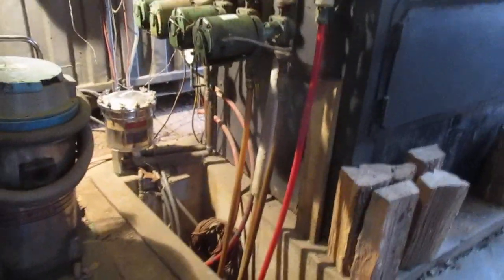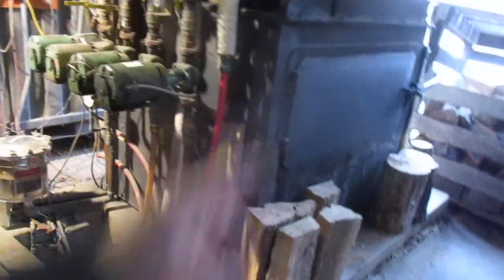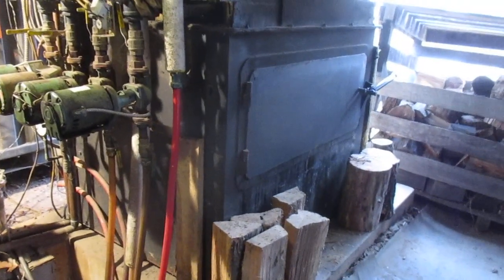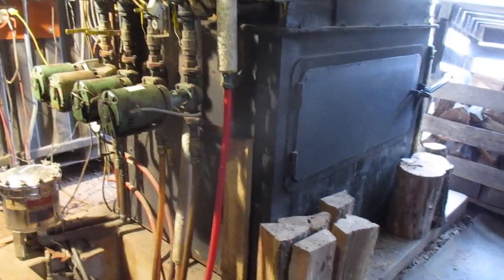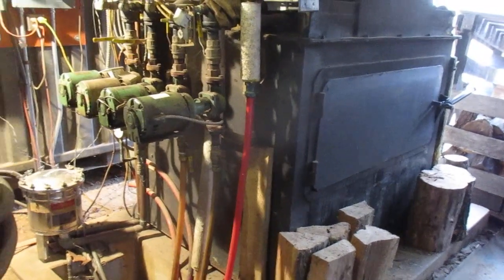It's condensate — it's the moisture in the air. That machine is like a dehumidifier. I can only say it's pulling moisture out of the air before it goes into the boiler. When the valve is shut on both ends it's not getting any moisture out, so it's got to be when it's running — it dries the air out before it goes into the burn chamber.